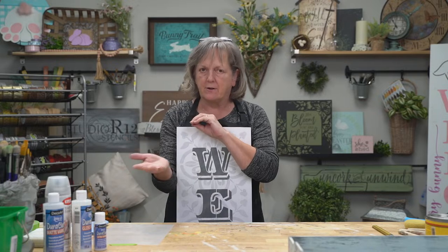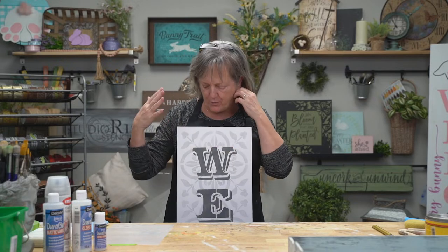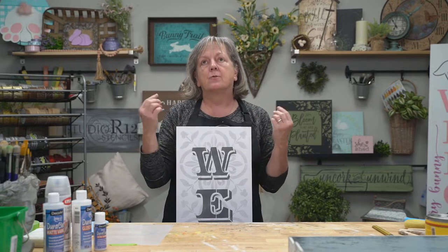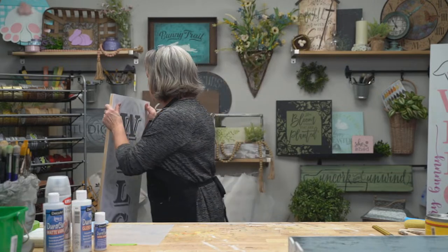What happens when you varnish is you create a paint sandwich. Paint has sealer in it, so you are sealing when you paint. You put your paint down and then you put your varnish on top. They are meant to permeate each other. And so when they permeate each other, they are making a stronger sandwich, or stronger bond. So when you have something that's going to be in the tough elements, you are going to add protection: weather, scuffing, dogs, all the things, UV. So that's a really good reason.